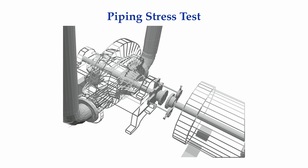When pipes are attached to machinery, you cannot visually see if there is an excessive amount of piping stress present. Prior to attaching the suction and discharge pipes on a pump, one way to check for excessive piping stress is to rough or final align the machines. Attach brackets to one of the shafts, span across the coupling, and place a dial indicator on the top and another indicator on the side of the other shaft. Plunge the indicators in a little bit and zero the indicators. If you only have one bracket and one indicator, set the bracket and indicator off on a 45-degree angle. You could also set up some magnetic bases on the base plate and indicators on the pump casing at the inboard and outboard ends to monitor any movement.